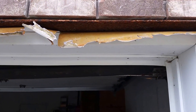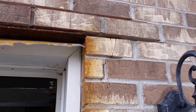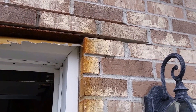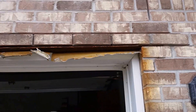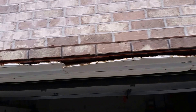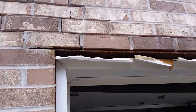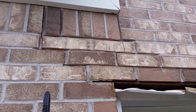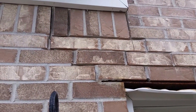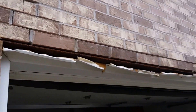You can see the excessive corrosion that's taking place. After you peel back that metal wrap, you can see on the side the brick veneer is starting to crack as well. Coming down as you grind out and start looking in the mortar joints, you can see that it's starting to pull away, which means that lintel will have to be replaced.